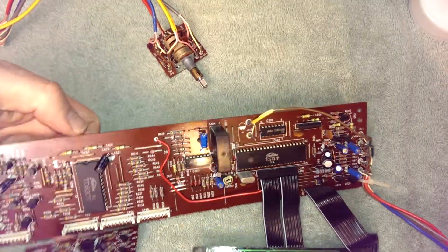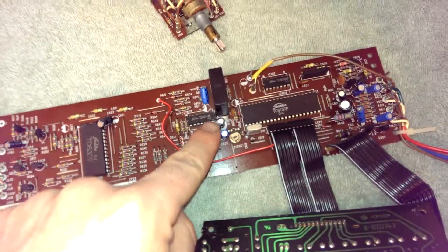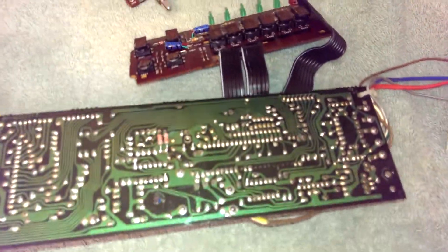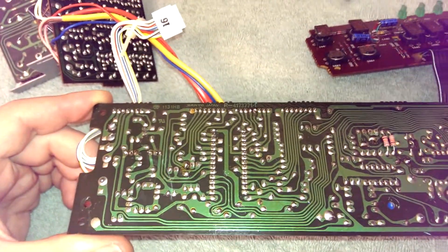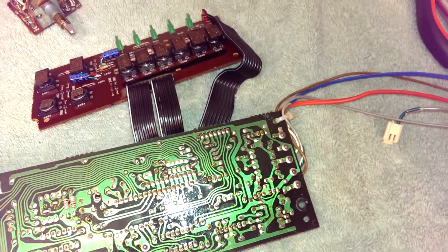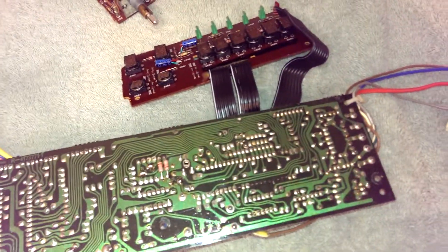Let's turn over the board and you can see what else I've done here. This board just got one cap replaced — this little guy right there. The rest of them look okay; that one I wasn't quite sure about, and if that one went, the whole digital section of this receiver would go crazy. No big flux buildup — there's an even distribution of flux but no huge pileups. This doesn't need to go through the flux remover. There are no cold solder joints either because this board doesn't get hot — it doesn't expand and contract as much as the power amp and other power supply components.